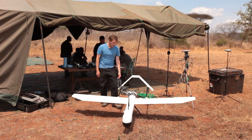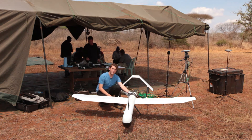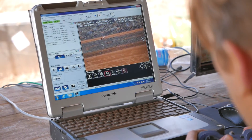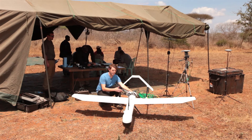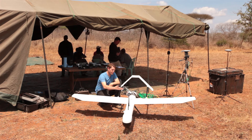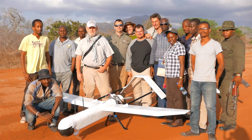We also have an alternator attached to the motor, so that when we're flying we're generating electrical power from the gasoline engine, and that gives us the ability to fly for much longer because we don't need to carry as many batteries. When we're doing our pre-flights on the ground we're using battery power, but as soon as the engine is started, the engine is generating electrical energy that charges our batteries and powers the systems in flight.